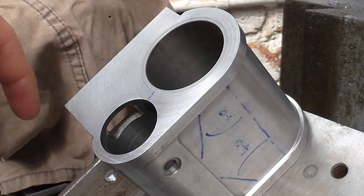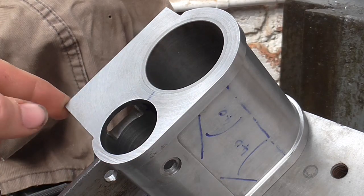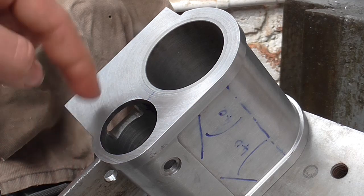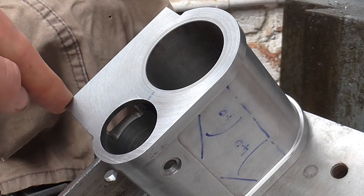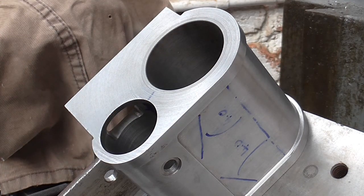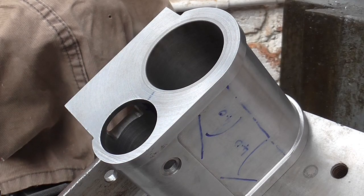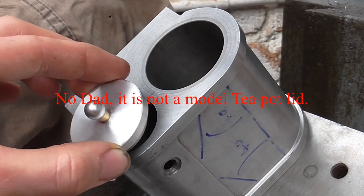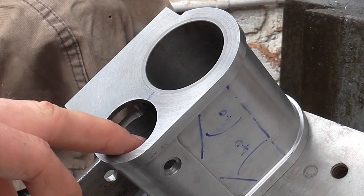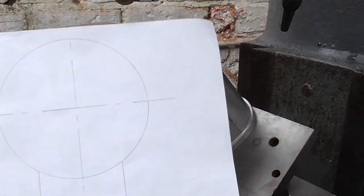For just about every operation so far I've datummed off this corner and moved over to the required point — that's pretty standard for all machine work. However in this case I can't do that for two reasons: one, the faces aren't in line with the machine's axes so I can't really use a normal edge finder to accurately pick up any of these faces, and secondly, even if I could datum off here, the faces I'm working on are actually out of line so I can't move in the normal way. To get around this I'm going to use a datuming method that's quite commonly used in components with angled faces or strange profiles, and that is to use a thing called a tooling ball. This is one I've made at home, and this fits into a bit of the component — in this case this ball — and it allows me to translate the datum into something usable at this angle.